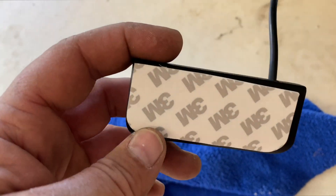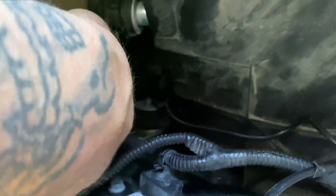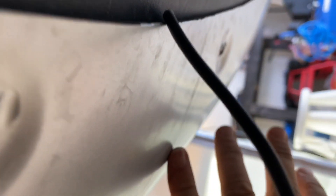First I need to wire the cable to the sensor on the underside here to get it under the lip. Then I'm going to do the rest of the wires — double-sided tape on each side — and the cable is going down on the right side. I have to pull it through with a wire threader, and since I have the Unplugged Performance front lip, I have a lot of room here.